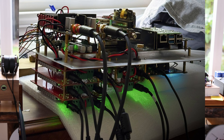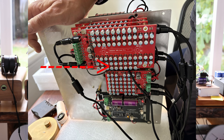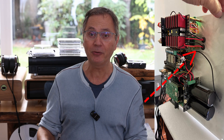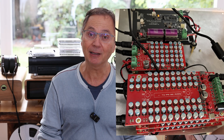The top part is where all the DAC components are. You can see some of Ian Canada's streamer parts and my Gapster TD1 DAC. And on the other side, you can see a lot of my Gapster CRC filters, and Ian Canada's Pure Pi as well on the bottom. Basically it's a two-sided thing, trying to isolate the power part from the DAC — a clever way because that gives you the shortest wires from the CRC filters to the DAC itself.